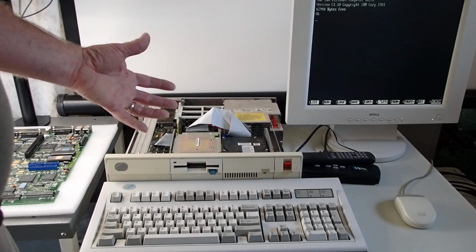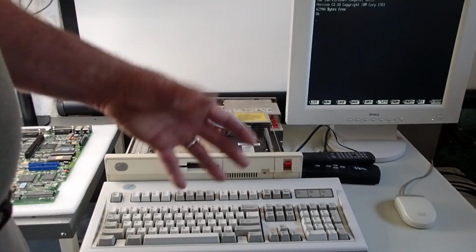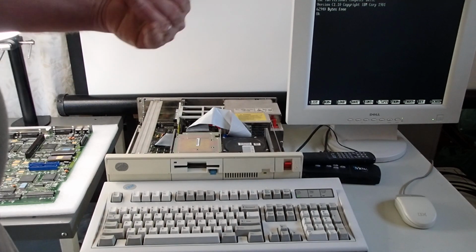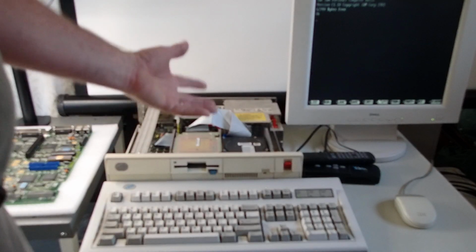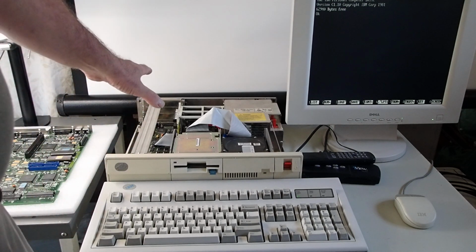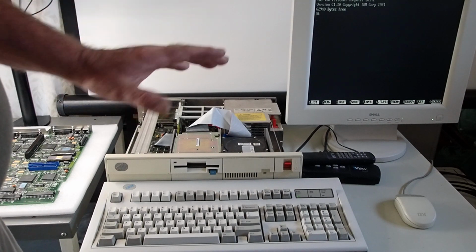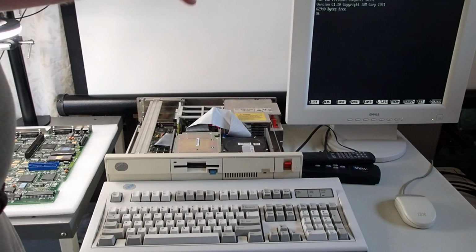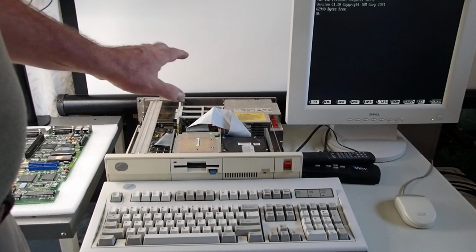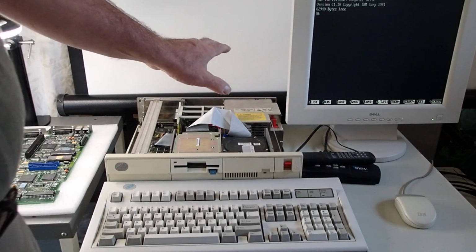There's not really anything to the time or date sensitive nature of this, especially with the Model 25 not having that real-time clock. The unit's powered on, it doesn't even know what year it is. It's likely just these components that are wearing out. They're drawing a little bit more power, the capacitors are wearing out, and things like that. And so we'll go through and diagnose this issue a little bit further and see if we can come up with a solution to it.